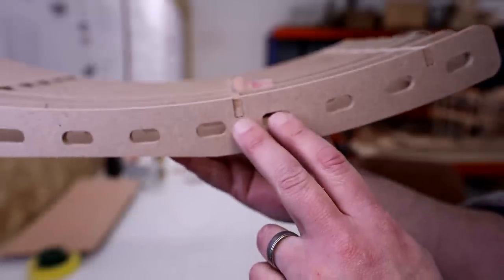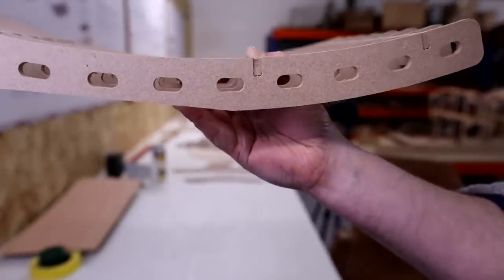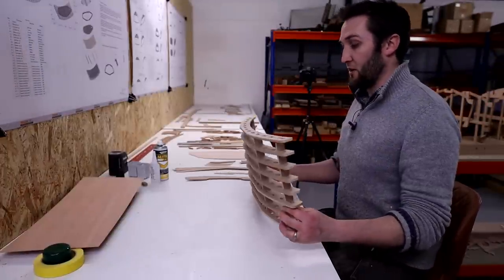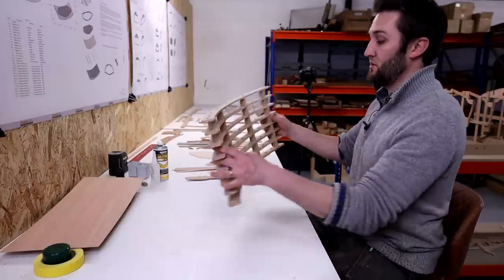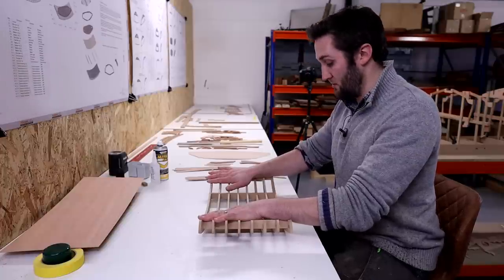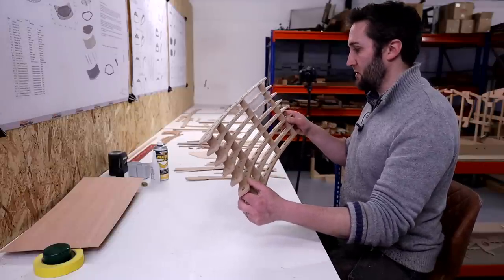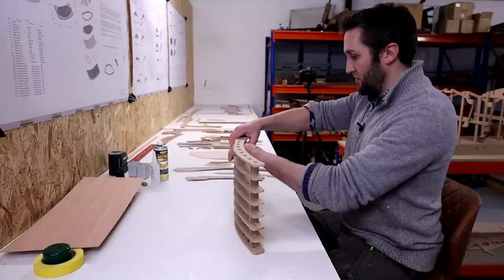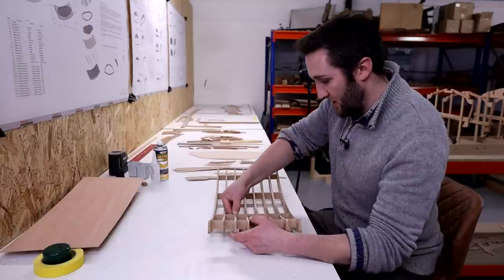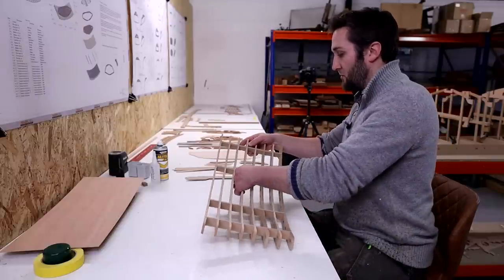You can see an example of how those little dog bones just clear a corner so that we can get a square part into a non-square cut hole. That is the transom cradle made up. You'll notice there's a flat on the bottom side of the mold forms so it can sit on a work surface — you'll probably be working on the floor with the full-size boat because it's going to be quite big. The joints are actually really tight fitting, so I haven't glued those. If you've got a little bit of play in your joints, I'd probably just slot everything dry and then fillet the corners.